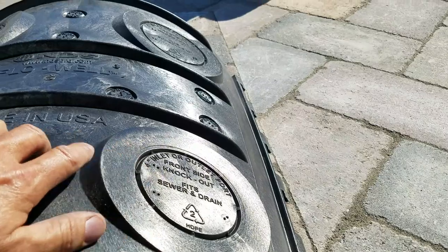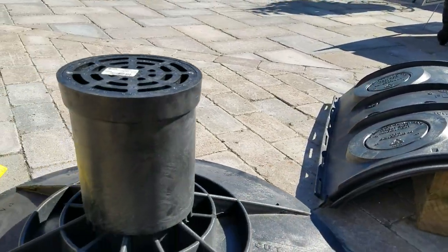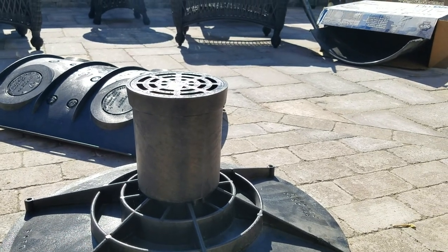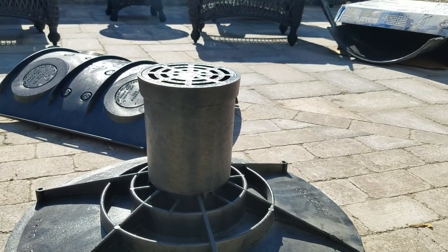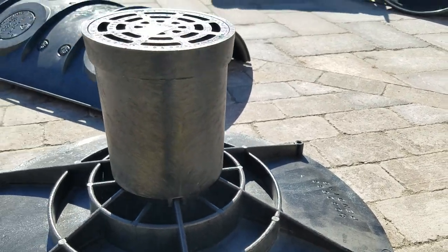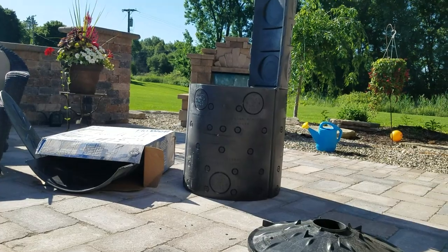Go ahead and knock out your drainage holes, then knock out your inlet or outlet pipe openings. Always — always — put an outlet basin on top. Some designs call it an inlet basin, but I like it as an outlet basin: if the system becomes overwhelmed, you need overflow protection. This lid to the Flow Well dry well — you just knock out that center part really easily, put the basin on top. These run about $25 to $35, making it a very affordable way for a homeowner to do a dry well.